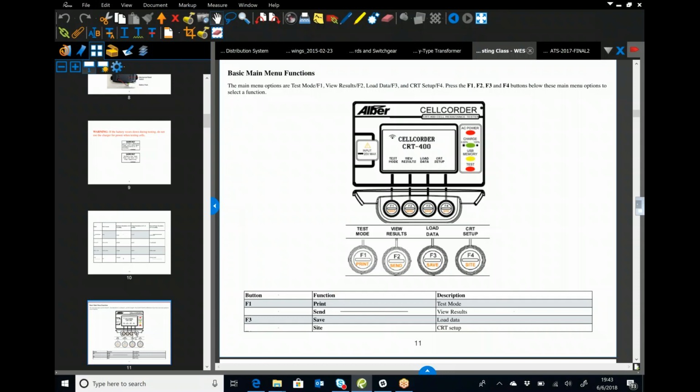One thing I want to point out, and we've had guys at WES that have forgotten this or have never had the chance to use it: you have to do your float readings first. You take those voltages, you get all of your voltages. If you've got 10 jars, you take every single voltage first, before resistance. The reason is every time you hit that test button, you're applying a certain amount of load onto that individual jar. Since you're in float mode, the charger is going to spike up to try to compensate for that.